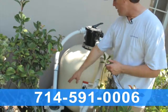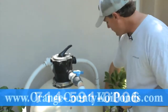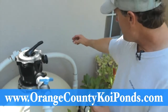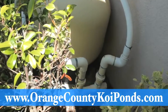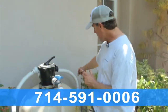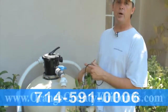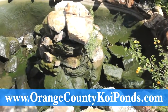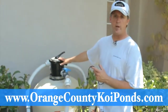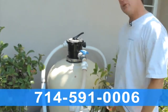You've got your water going from the pump into the filter, out of the filter, and through a UV light. Unfortunately, this was plumbed incorrectly because what needs to happen is the water needs to go through the UV light slowly, but we have the full force of the flow going through it. So it's not very effective at all. Also, this bulb is burnt out — it's not working, and that's probably one of the main reasons the water's so green. Also, I don't think this was back flushed regularly.